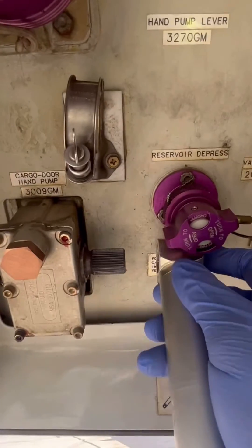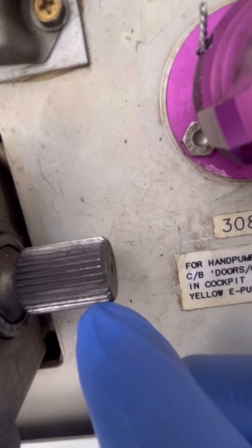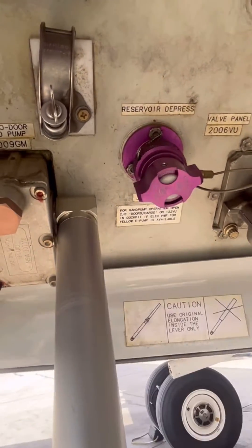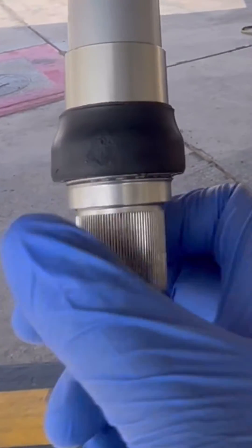The extension lever is actually built inside — you screw it out and then screw the other end, and voilà. The quick tip I wanted to give you on connecting the lever to the pump: look for the master spline in the ridge. You'll see there's one thick spline and one thick ridge — just align those and it clicks right in. Our pump and lever are now ready.